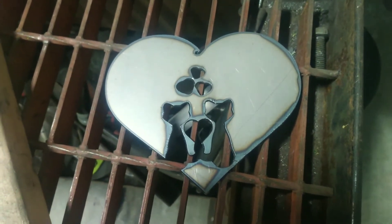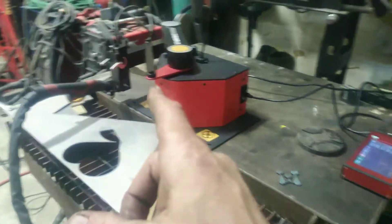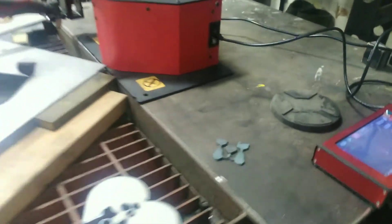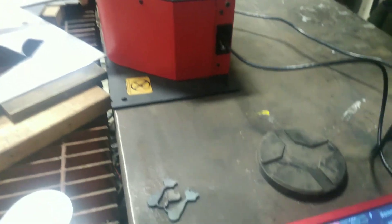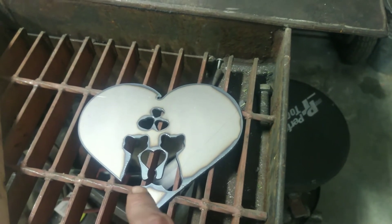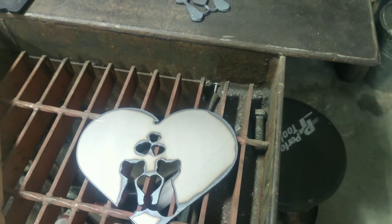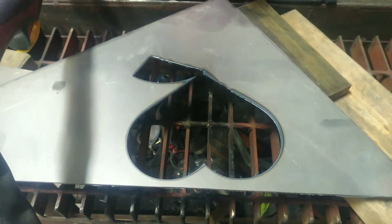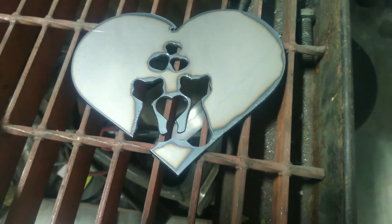This is just a learning curve, but this is real world. When you buy a new gadget like this Arc Droid and you don't know CNC, CAD, and all that stuff, you have to learn. I just bought this thing, sat at home and watched YouTube videos, kept learning and practicing. I'm close — I just laid this out a little too tight to these edges, so my curve just cut the cat's bum off a bit. I should have had this start up over here, cut down and over.